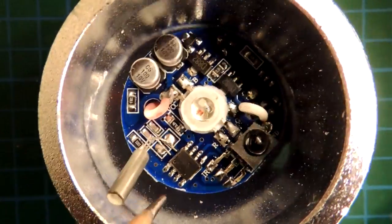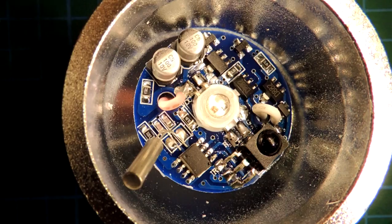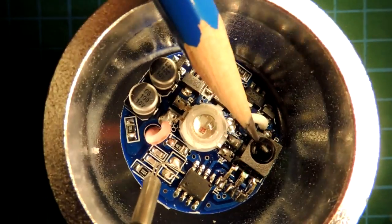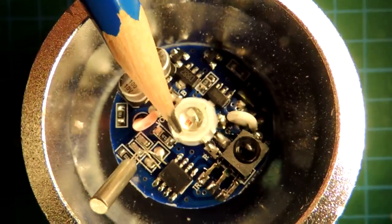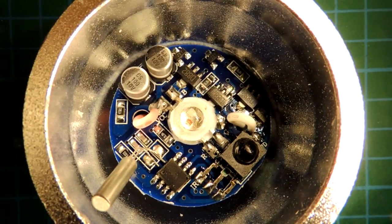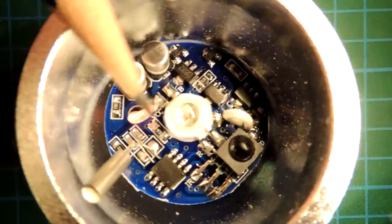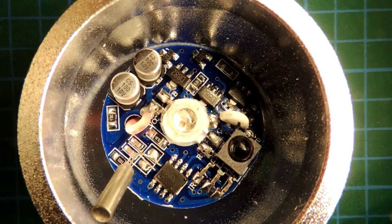So it's what you'd expect. This is a 4 MHz crystal here, and a small 8-pin SOIC with all the markings removed — a very traditional sign that the manufacturer is trying to keep competitive details away from their competitors. I would presume it's a microprocessor of some sort. This is an infrared receiver used to control the LED's behavior. It's a single LED package actually, in a single package with a lens on top. Otherwise just some electrolytic capacitors and transistors to probably drive the LED. A real straightforward assembly — it looks quite competent.